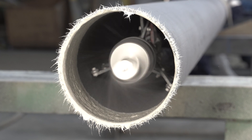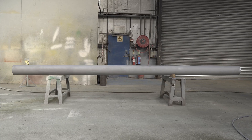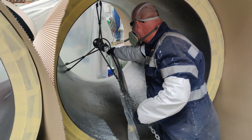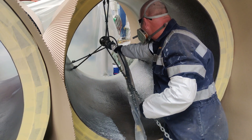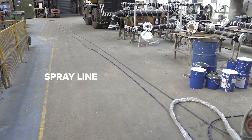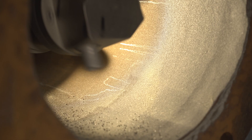We are going to demonstrate the application of Coracoat Fibre Coat to this 6-inch nominal bore pipe, which is 5.3 metres in length. Fibre Coat can be applied in pipes from 150 millimetres to 1.2 metres in diameter and lengths up to 100 metres, and can also be applied up to 3 millimetres in a single coat, meaning pipes that have thinned or suffered pitting can be strengthened.